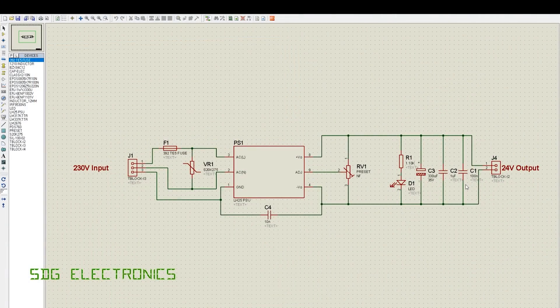If we have a look at the schematic you can see it's very simple. We've got our 230 volt input on the left, although it will accept 115 volts as well. We've got a series fuse and a varistor to protect against surges and overcurrents, and we always put that after the fuse - because if there is an event that causes the varistor to break down it will blow the fuse and protect everything on the PCB. If we had it the other side of the fuse it could continue conducting during a continuous overvoltage event and could eventually cause a fire.